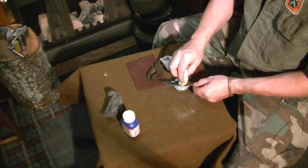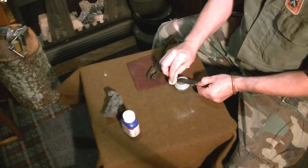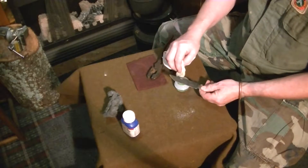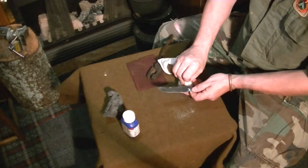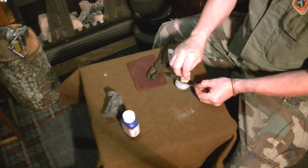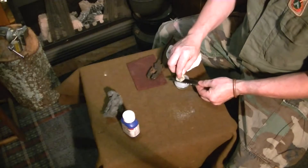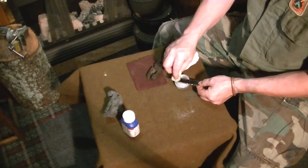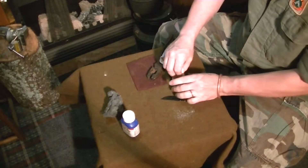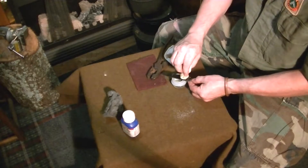Now it's a slow process. If there's oil or anything on the blade, it will seem to resist more. It's just a matter of how many layers you want to put in there. Getting a little of that salt on it is actually the secret — you want to pick up salt out of the bottom of the container on the rag, and use that to kind of score the stainless as you go along. This bluing salt, for lack of a better term, is what does the lion's share of the work.